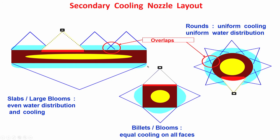So, what is the problem? On three surfaces, the nozzles are okay, they are getting an adequate amount of water. So, temperature also is coming down systematically. On this surface, no water is there, the nozzle has started malfunctioning. So, there is no water on this surface. On all three other surfaces there was water, which is indicated by the blue regions here. That means uniform water is falling on the three surfaces. Here, you see no water.